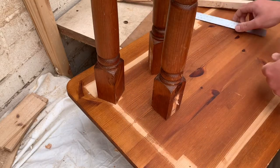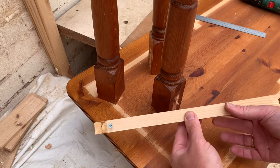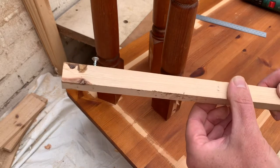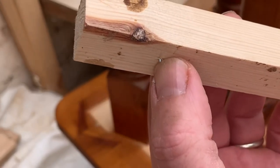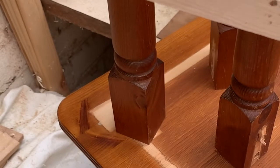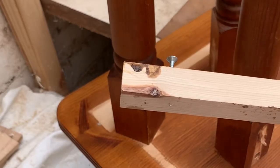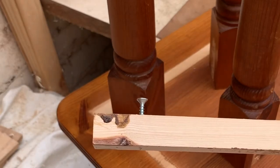All we need to do is put a trusty old screw through a stick and then mark off half that distance to drill a hole we can put our pencil through. I've put this screw in here — notice it's only just poking out the other side. That's enough to grip into the wood so we can draw a nice circle but it's not going to put a great big hole in it. I'm also doing it on the back section where it won't be seen — I don't want to put extra dents in the top that I'll have to plane out later.